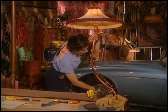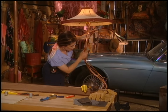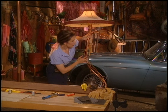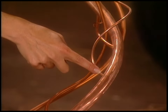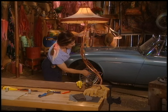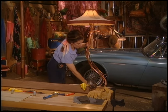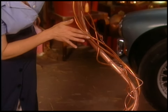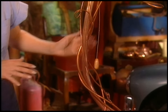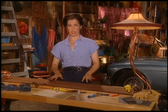Just a quick thing to show you — this big lamp, I actually use this as the main trunk of my lamp, but it's not carrying the wire. That's because I drilled into this main trunk to put these little branches off. I actually had to carry the wire up in this other bit of pipe because I didn't want the cord getting cut by the burrs of metal that were inside where I drilled.